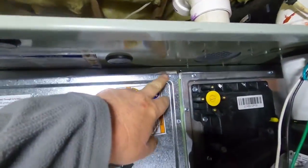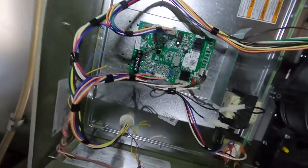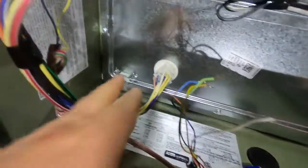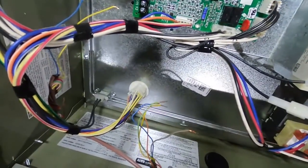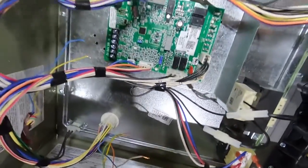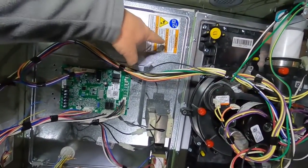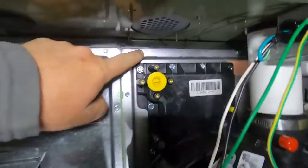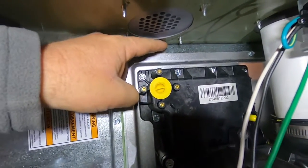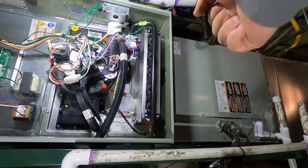This panel basically comes out - you see all the screws. Most of the older units everything was flush. Most furnaces don't always have a door that covers the blower - Trane is famous for that. Take this plug off here; there's your door switch down there. You can troubleshoot through this switch. There is another limit sensor in there and a reverse-direction limit - I'd have to look up exactly what they call it. Once you get this door off, the blower is in there on rails and just slides right out. The heat exchanger is the same way. You see it's not all flat but it has a built-in frame, so once you get the screws out all the way around the heat exchanger, it will just slide right out on rails.